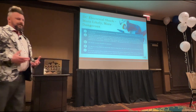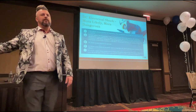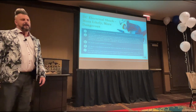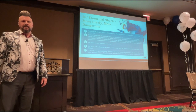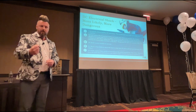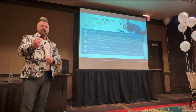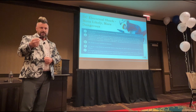So DC shock causes the muscles to contract. If I get a fork now and I'm an idiot and I walk across to a power socket and I jam that fork in there, what's gonna happen to me? Yeah, it's gonna throw my arm back. DC electric shock does not react like that. What's going to happen to me if I've got a water-fed pole in my hand and I start getting a DC electric shock? I'm going to stand there. Literally I've got my pole in my hand, the panel's in front of me. I'm going to stand there and the whole of my body muscles contract. So I stand and I can't move. If you're all watching me, eventually I start smoking. I'm going to start smoking because I'm burning.